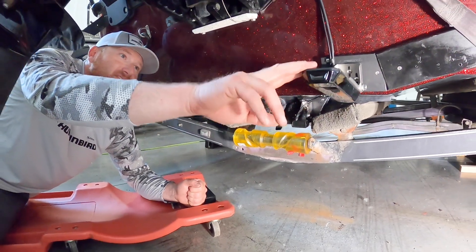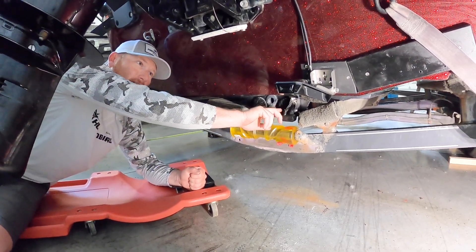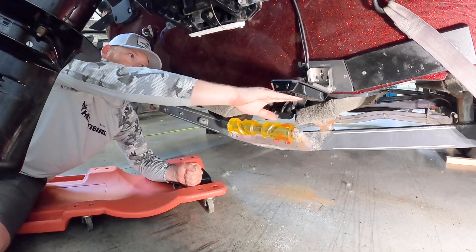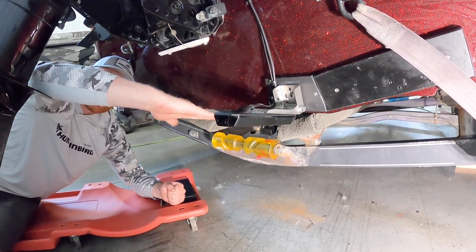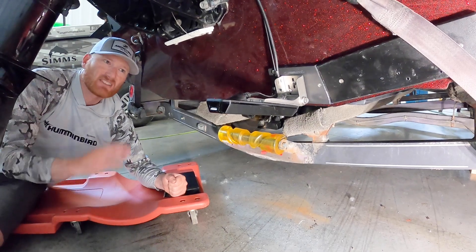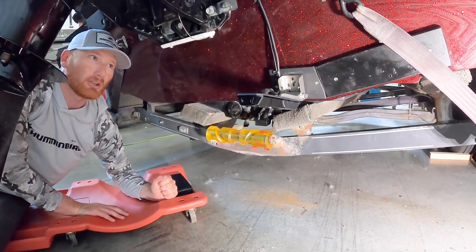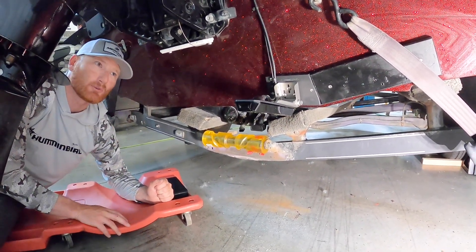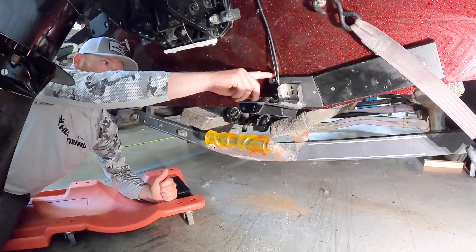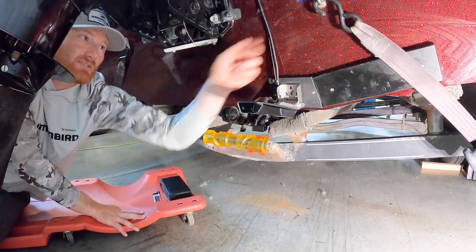This is going to be just for my 2D. Moving up here you can see we've got my Mega Side Imaging and Down Imaging, which also has 2D, but we're going to run this on a Y-cable so all of our 2D runs off just the skimmer. The side imaging and down imaging will run without interfering. You can make really nice little adjustments on this board — this transducer is going to need to be angled up a little bit so it sits flat while running two to five miles per hour for fast idling or fast fishing.